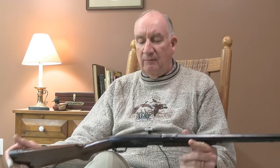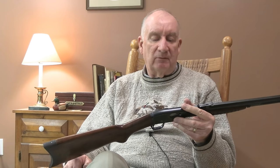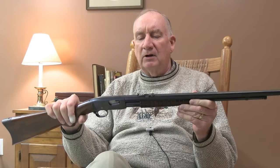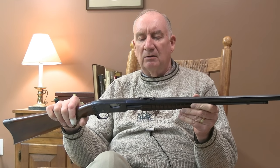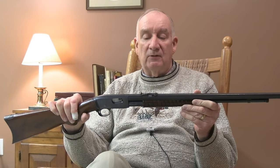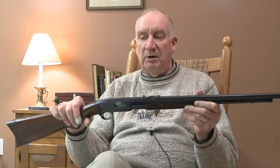So that's it — it's a great little rifle. This has obviously been around a long time; I would say the better part of a hundred years, and it's probably going to be around a lot longer. I would say this is probably a candidate for having it re-sleeved if it could be done by somebody who is very skilled at it. That would mean the barrel would be bored out and a liner would be silver-soldered in place — that would probably make this rifle into a very, very fine shooter. That may be something I could consider doing.